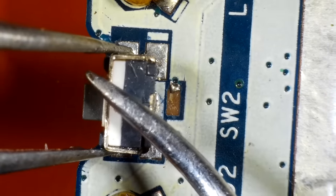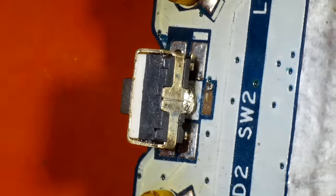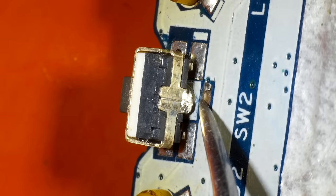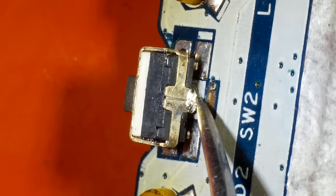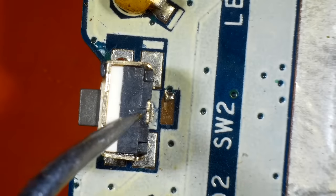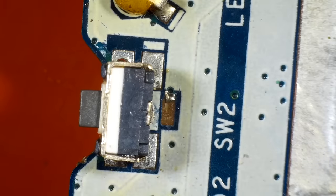We need to see if this button will fit on this board — and that actually looks pretty good. These are the pins we need to make sure are connected to these pads: this pin to this pad, this pin to this pad, and then this pad right here is what was connected back. This button definitely does not reach all the way back there, but with these two mounting pads this is still going to be a pretty solid fit. We just got to get these two pins mounted, then fill in these holes, and that will secure this button to the board.